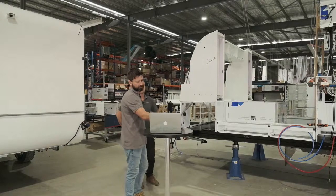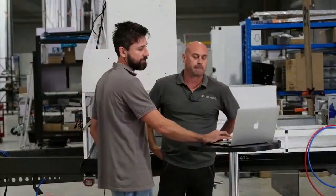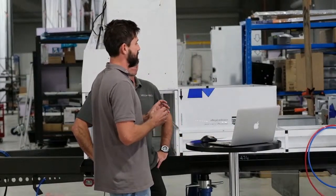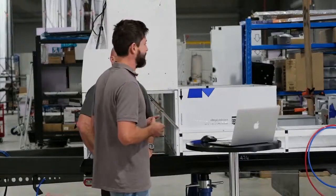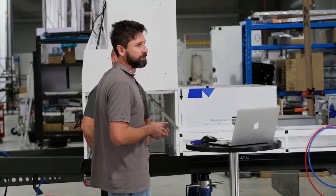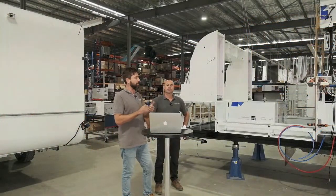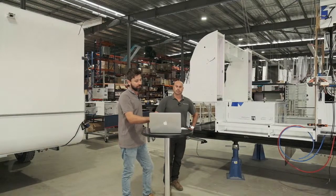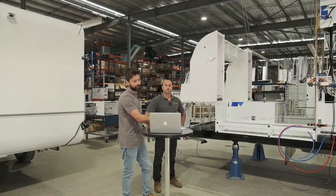Cool, mate. Well, that definitely summarises a few of those questions. There's obviously the glues, and to summarise on that, it's just a bunch of polyurethanes and MS polymers, which in really simple terms are single part glues. They've got really high elongation. As I was talking about before, corrugations are really the killers of caravans. To have a glue that is really flexural, because these vans do move around, and the glues aren't brittle, which a lot of brittle things in these applications will just crack. So those urethanes are a really key component in this whole external body arrangement.